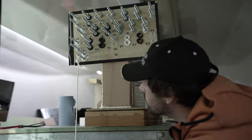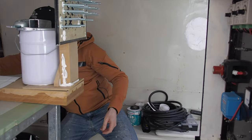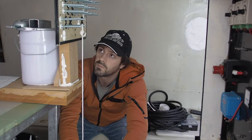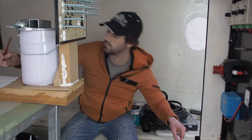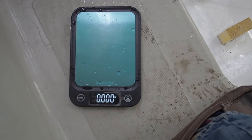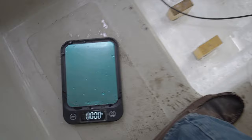To gradually increase the weight on the end of the bolts without causing a jolt, I hung a bucket and carefully poured in water. Some adhesives failed in an instant and others sagged first. I judged the point of failure to be when, if I stopped, the sagging would continue without my help. I tested a pair of bolts for each adhesive to check for faulty or otherwise weird bonds.